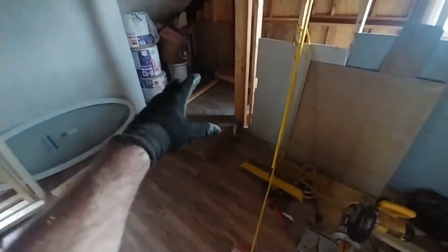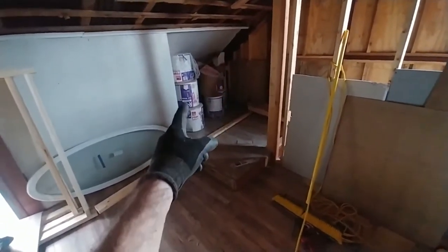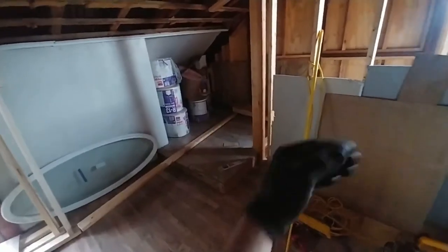You wouldn't wall it off and leave a weird step up. It's just total jank. So you'd have a wall here anyway. So you're working with this room as though there's a full wall there anyway. And so you really ought to take that out because it's not even 100 square feet. This is my professional opinion. It's not even 100 square feet, and it's got diminishing headroom. And you're going to work around it as though it's a full outside corner. Just make it a full outside corner. Give yourself the headroom on the stairway.